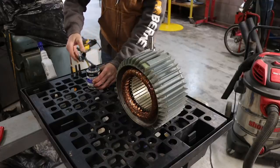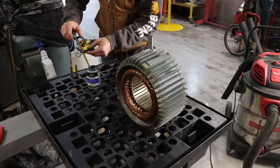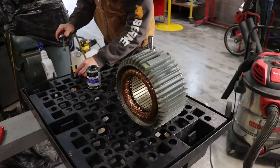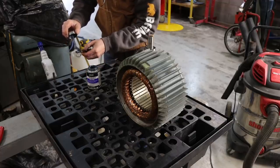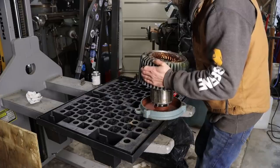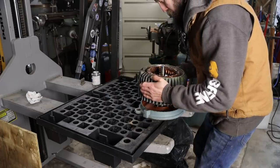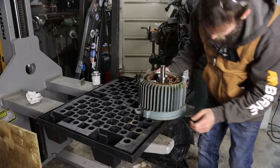I've seen equipment designed in a way that I really don't see how you would avoid pressing through a bearing, and to a certain point, a little bit of pressure won't hurt anything, but you start bringing hammers and stuff into the mix, giving those really heavy spike loads, and that's where you damage your bearings. Just a nice press, and those bearings can handle a lot more axially than what you would think before you really start damaging the bearing.